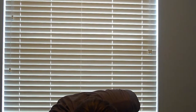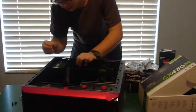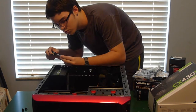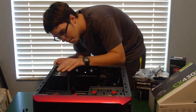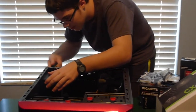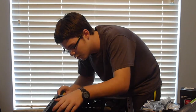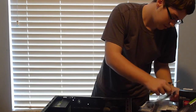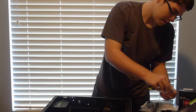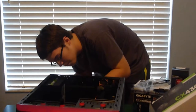I'm going to go ahead and install those. Let's flip it around so that I can see it — much better. Screwdriver, very useful tool. Get that one nice and screwed in there. Pro tip: do the screws opposite each other first, and don't tighten them all the way. Then you can do the other two, and then tighten them all down, just so that you get better balance. Everything just works out better that way.